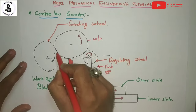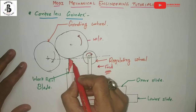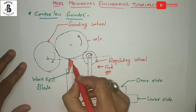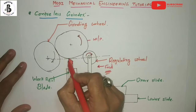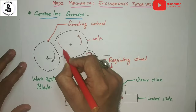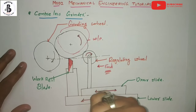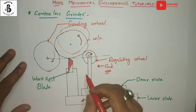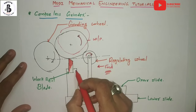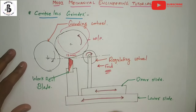If the job's periphery passes through the center line, that would give good grinding efficiency. However, if the job axis is too far above the plane containing the axis of the grinding and regulating wheels, the job is not properly supported, and this will increase vibrations during the centerless grinding process. Usually, the height of the job center line from the center line of the wheels is kept at half the diameter of the job, with a maximum of 12 mm.